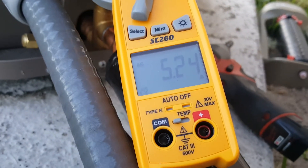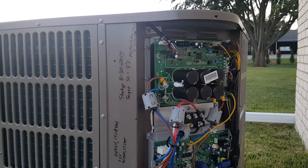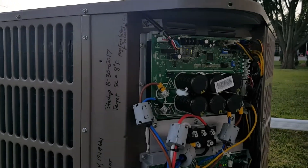If you look down here at the amps, this thing is running right now at 5.2 amps. This is a regular four-ton condenser — you could be anywhere from 14 amps to about 24 amps running. This will actually run a percentage of what a normal unit will run.